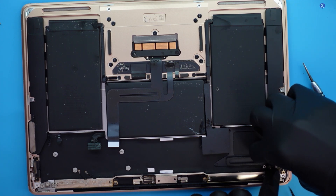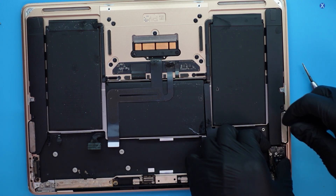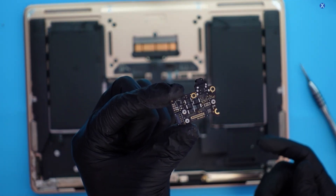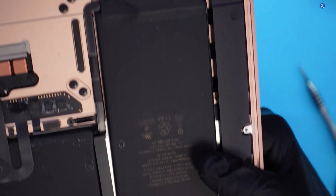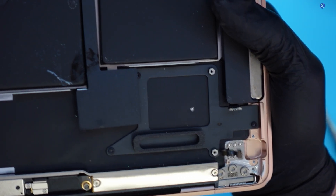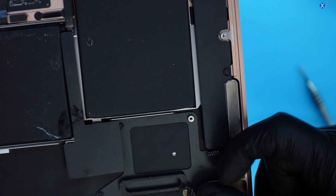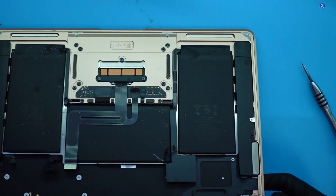It's always good to check — if there was anything obvious here without a more obvious liquid spill we'd always like to check that. Now here's your side I/O board and it looks like it also got a little bit impacted, but probably doesn't look too bad — these are always replaceable in a worst-case scenario. Our Touch ID and power button area got a little bit of liquid damage here, but it looks like the coating kind of protected it. Maybe we can do a little bit of a clean and that should probably be it — nothing was really burned.